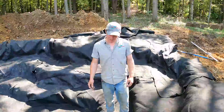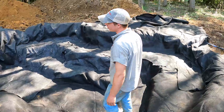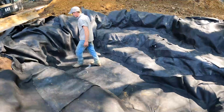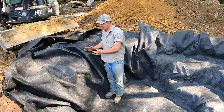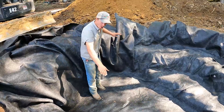Let the fun begin! Here's the freshly excavated pond — we've got thick felt in it for liner protection; we always use a bit thicker stuff on bigger projects because of the large rocks. We're flipping back the liner and then rocking this baby in. The new patio is going to run right along this edge, and I'm thinking of setting two big boulders right here, plus a nice flat rock that's a bit higher in the back and dips off toward the front.